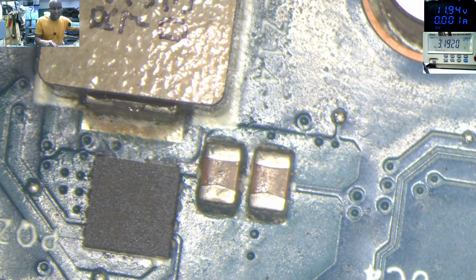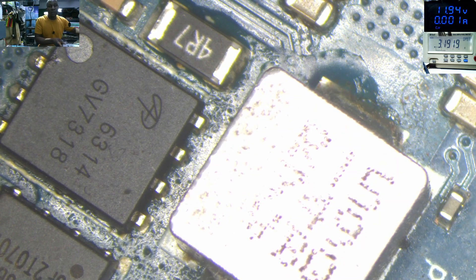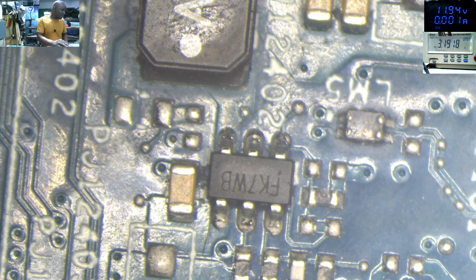Those ceramic capacitors which I checked here, and I also checked here. You see those capacitors — here in the corner. My input MOSFETs must be on the other side of the board. Check those capacitors. I think our problem is here. Look at these capacitors. You see? This one has got a crack — this is a cracked capacitor. I think we just found the problem.